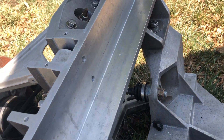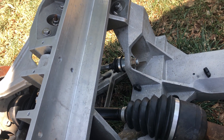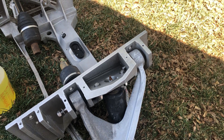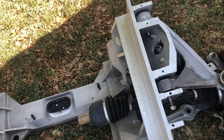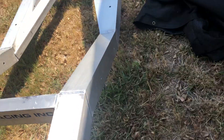This is Rick Dobberton's suspension pieces. What his pieces consist of are these uprights right here — this cast aluminum piece here and here — and then the rest is all C5 Corvette stuff. What his pieces do is correctly locate the suspension arms for the upper arms, because on the Corvette itself these upper arm mounts are built into the body of the car. So when you put this in something else it no longer has the body as a reference. These angled pieces here are designed to go on the outside ends of the frame rails.